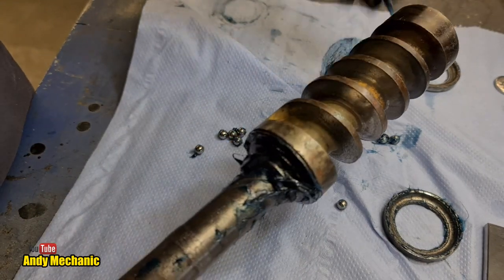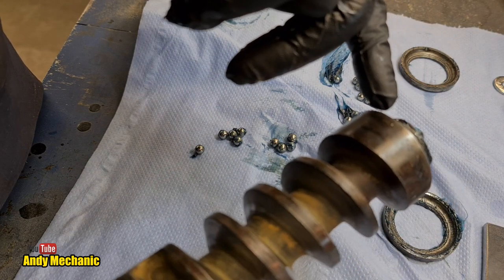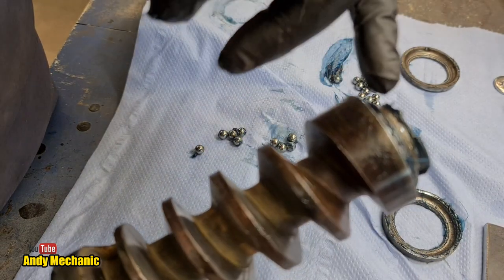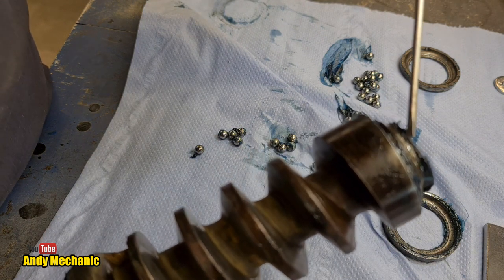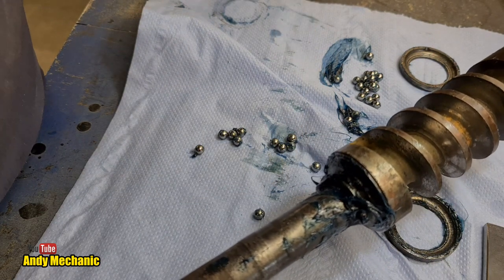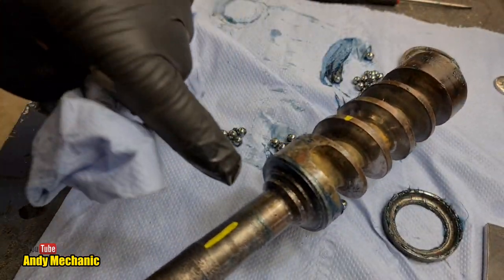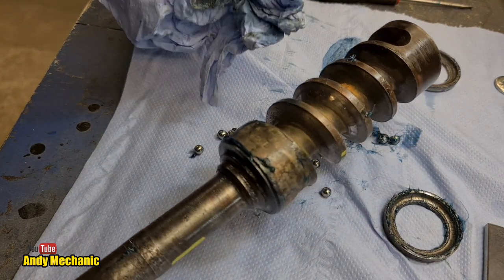Right, so this is the shaft that I need to clean up, get rid of all the grease, and then we're going to get the ends, this area here ground down, and this area here ground down, to take those taper roller bearings that we're going to use. Because, like I said during the intro, this race here is actually part of the shaft, as is the inner race here as well. We can't do anything with those, unfortunately, other than wipe a bit of grease off them. There you go, we looked on the microscope camera and we could see quite clearly it's all one piece. You can just tell when you look at it, to be honest. So we have no option, because we can't get a new one of these. They're not available anymore. Bugger.